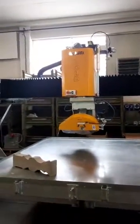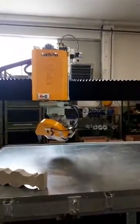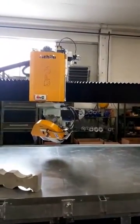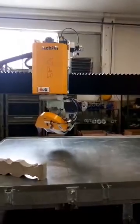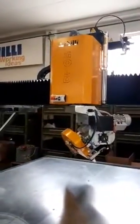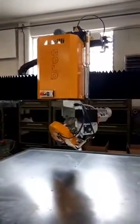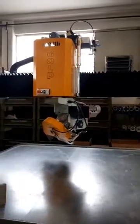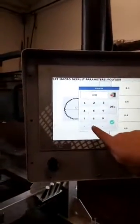We have come to the end of this live. Let me check if there are some questions. How long does it take to manufacture a bridge saw? Approximately 45 to 90 days. Is it possible to cut circles or ovals on the saws? These machines and the software used do not allow perfectly round shapes. However, the macro environment permits drawing particular point-to-point figures, making it possible to approximate a circle — the inner part can be used. In practice, the machine makes many diagonal cuts very close together to create a circle, so a round table top is feasible, but not a perfectly round cutout inside a kitchen top.